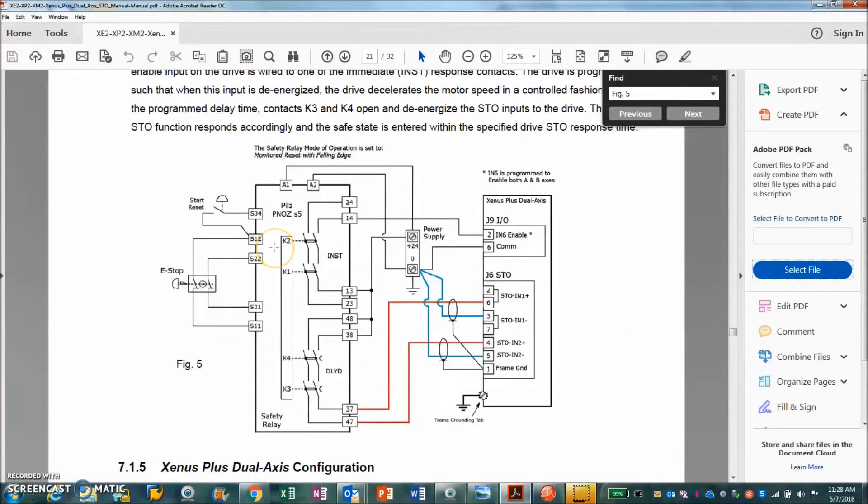This is the key diagram from the STO manual. It shows a Copley drive with a switch and a relay that has an instantaneous contact and a delayed contact. Before you disconnect the STO circuit, you probably want to come to a controlled stop. The instantaneous relay closes to tell the drive to hardware-disable. After you've come to a stop, the delayed contact closes and disconnects the output stage. So as you reach your hand into the machine — perhaps passing a light curtain or hitting the e-stop — the drive comes to a controlled abort decelerate, and then the contactor closes to disconnect the output stage. Even if something were to fail, at the end of the day you can stop and be safe.